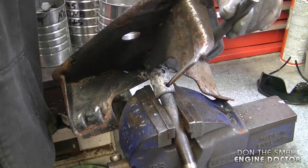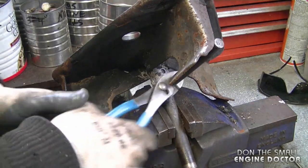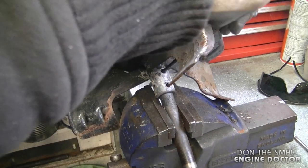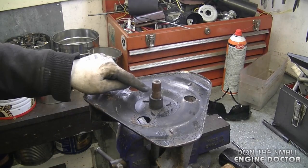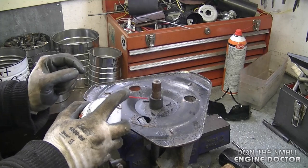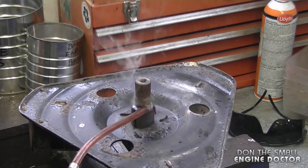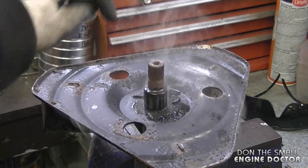You've got to go quick after you get the heat off. Be extremely cautious here because the impeller is super hot — make sure you have good gloves. Flip it upright. Now I'm going to spray some penetrating oil here. Since it's hot, it's going to creep right down between the shaft and the impeller. When you're just about to do this, make sure you ventilate your shop properly. Any kind of oil will work — the heat helps it go down. I'm going to leave this here for a few minutes and then try to pound it out.